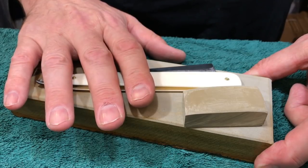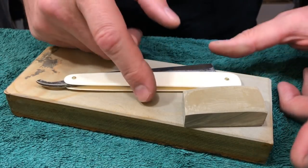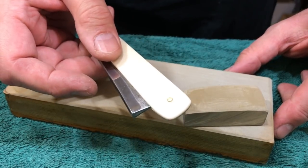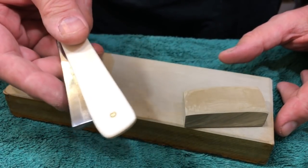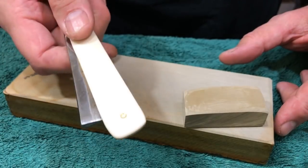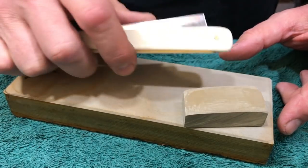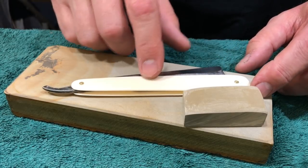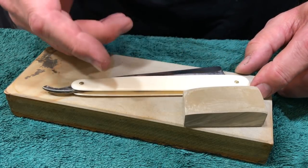And you saw earlier I did some shaving. That was on a bevel set, right? I shaved after I set the bevel on this with the 1.5K. I did some stropping on leather. Then I shaved with it, and that actually went pretty well. But this edge is like 1,000 times better, so you'll get to see that.